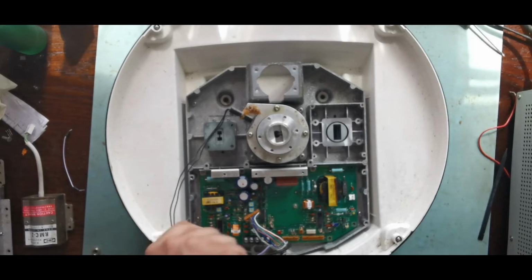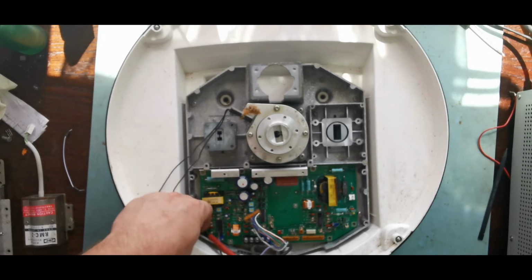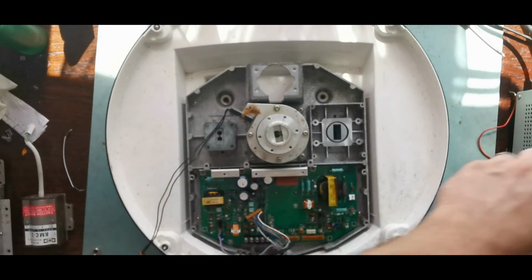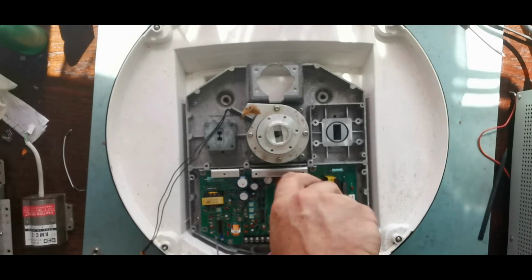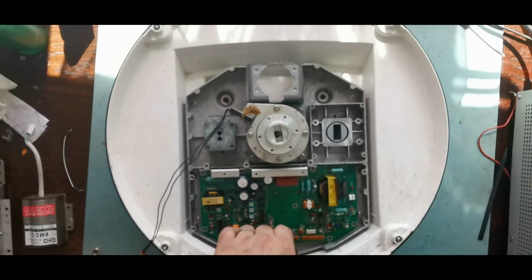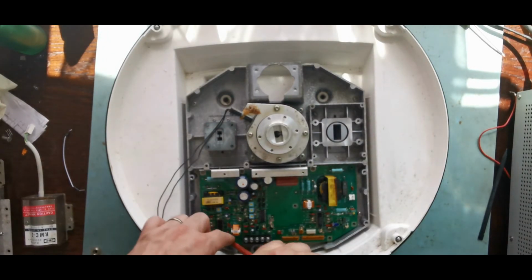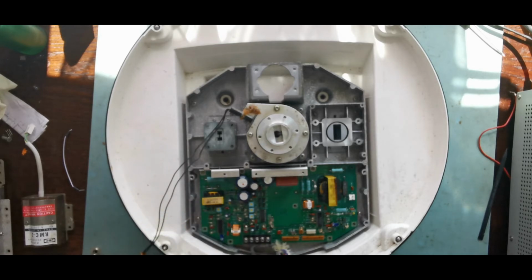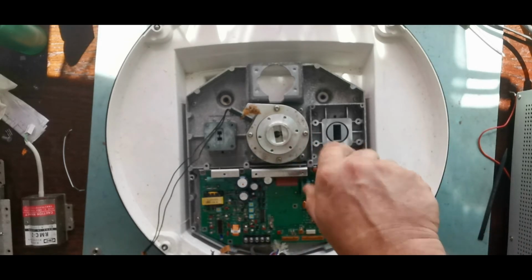Those of you who don't know how radar works, it's fairly simple. You send out a pulse and you listen for your pulse coming back. How long that takes is dependent on how far away the item you're looking at is. And obviously we use lots and lots of little antennas to form multiple beams, which effectively allows us to see a little better. Almost, but not quite, see around corners. Okay, we do need those heatsink clamps out.